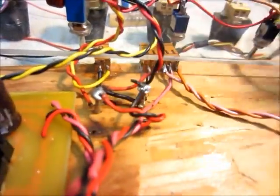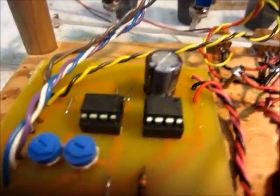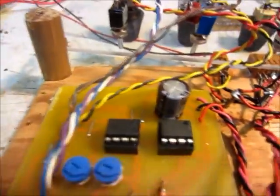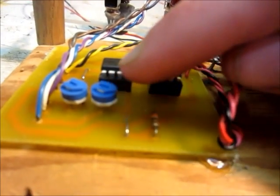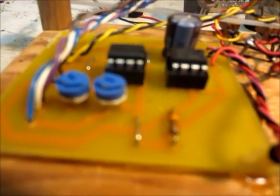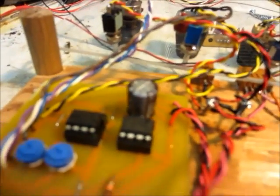Here's my power rail — I've just got two nails, I think they're brass nails, and those take the positive and negative voltages. That's 12 volts input from my power supply — you could run off a battery or whatever. And then here is my circuit that I built for this. This is basically a pulse width modulation circuit, and I etched it. These two little trimmers are just the duty cycle adjustment so you can adjust it so that the duty cycle is 0% off or 100% on.